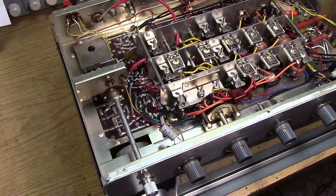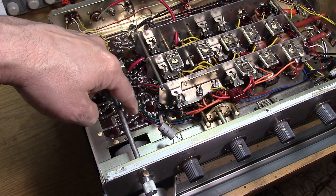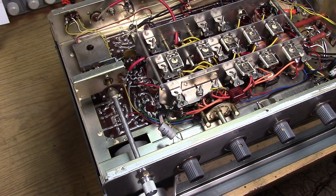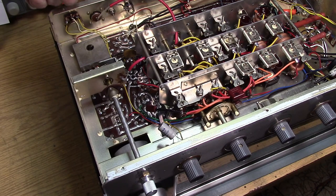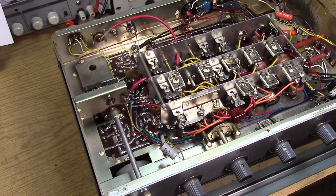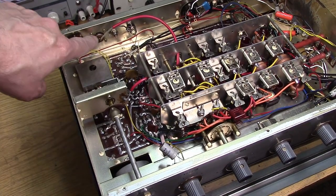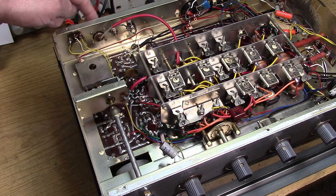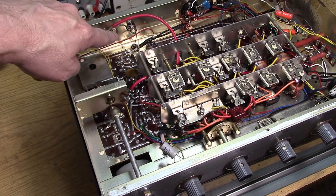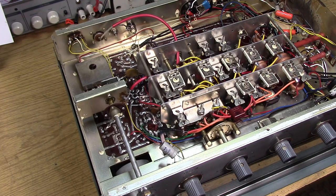You may remember that we removed a coaxial cable that was attached up on the circuit board and came out through the original hole where the antenna connector was. Like many of these hobby-type receivers of the 50s, 60s, and early 70s, they used an RCA phono jack as the antenna connector. The engineer that owned this realized that was kind of silly and mounted his own SO-239 connector — a proper antenna connector — and left the original hole open, which is where he ran his Q-multiplier cable out.